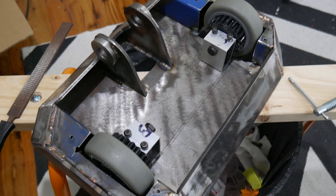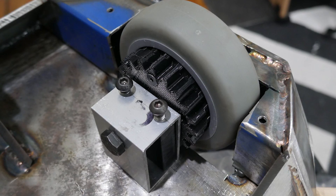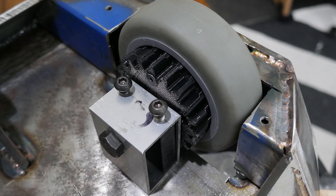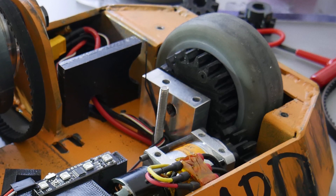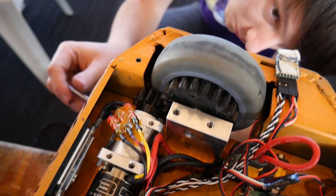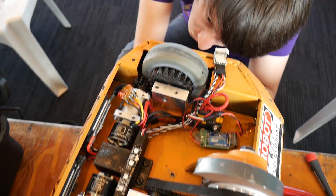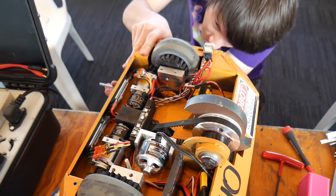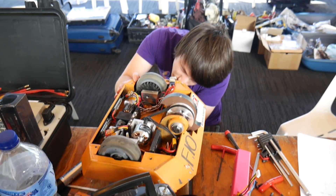The shaft for the wheels was less straightforward though. Originally I was going to use 3D printed mounts with aluminium, but both proved far too soft and I could see it just stripping out from just driving around. In the end, I lathed a 15-to-10mm spacer, got an M10 bolt, and got an aluminium block CNC'd with the thread for the M10. It just tightens up to the spacer and the aluminium block, and these worked fantastically.